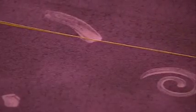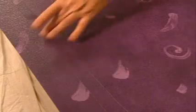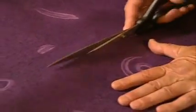In this case, the pattern repeats every 52 centimetres, so we look for the pattern match at the halfway point, hence the description of half drop. It's easy if you look for a distinctive shape or patch of colour that catches your eye. Once you've made the match, trim off the top piece of waste and put it to one side. Number the lengths by making a pencil mark on the top back area of trim, indicating the sequence and direction in which each length will be hung. Now you understand what a half drop is, consider yourself an expert.